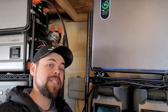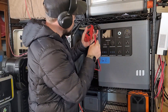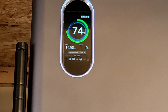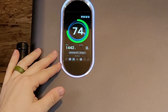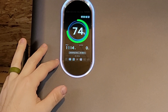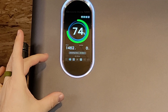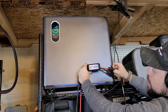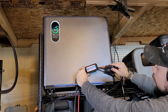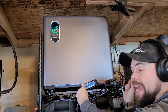What I'm going to try now is attach a second group of six panels to maximize the solar input. Volts is where charge controllers really get damaged, so I'm checking my voltage — getting 59.5 volts. We officially achieved 1,500 watts in. However, it takes being at 2,400 watts of panel capacity to reach the 1,500 watts. This is probably going down simply because there's a cloud in the way, but we officially did hit 1,500 watts there for a second. So the good news is we can get 1,500 watts input. Now I want to connect a 200 watt panel to the wind input — it shows about 50-60 watts. When I cut it, it dropped by about 50 right there.